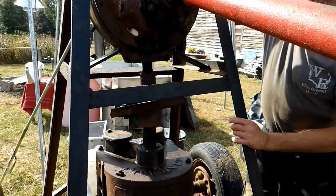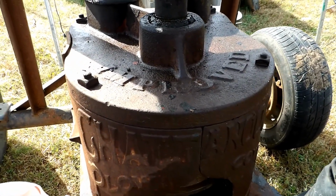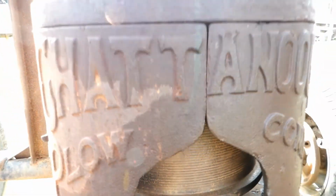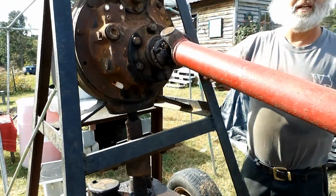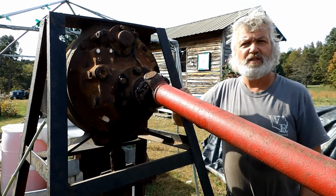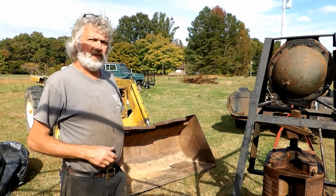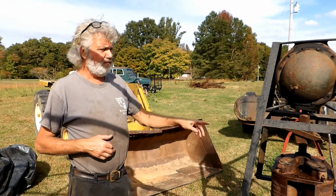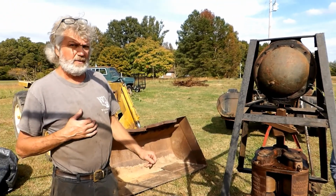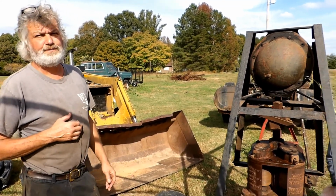But anyway, this mill had been sitting a long time, and we washed it out and put cooking oil in the barrels. It had some acorns and stuff where the squirrels had been living in it. But we've washed all that out, and we're fixing to run some cane in it just to clean the residue out before we start squeezing. We're fixing to crank the engine up, and we're going to run a few stalks of cane through it. I've polished these rollers here, but they've got a little light rust back on them, so we're going to run some cane through it just to clean that off.